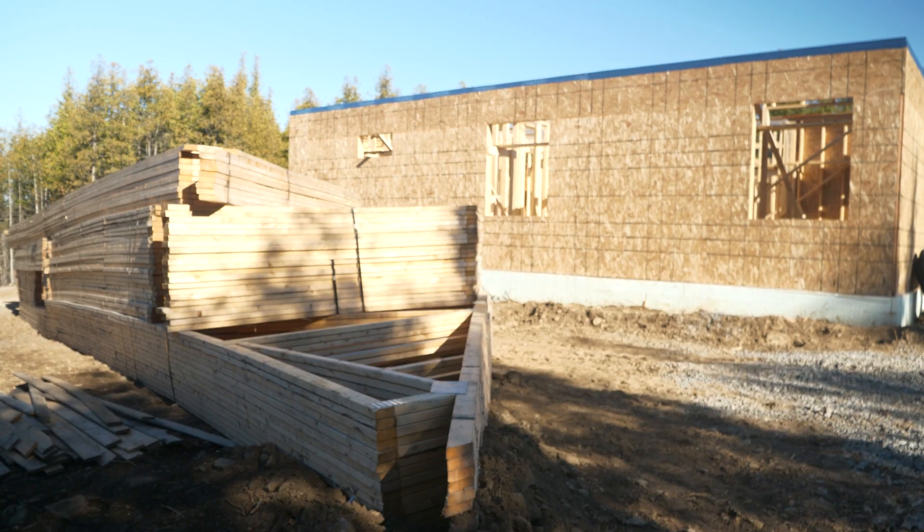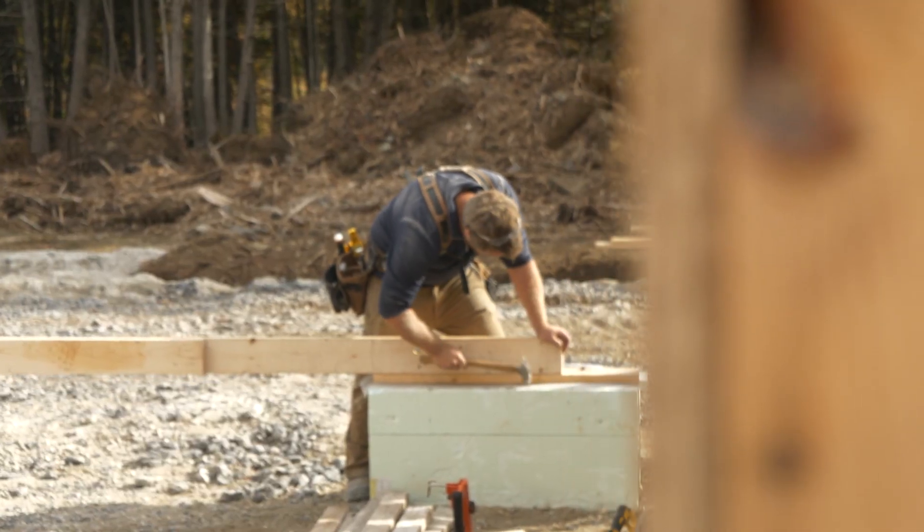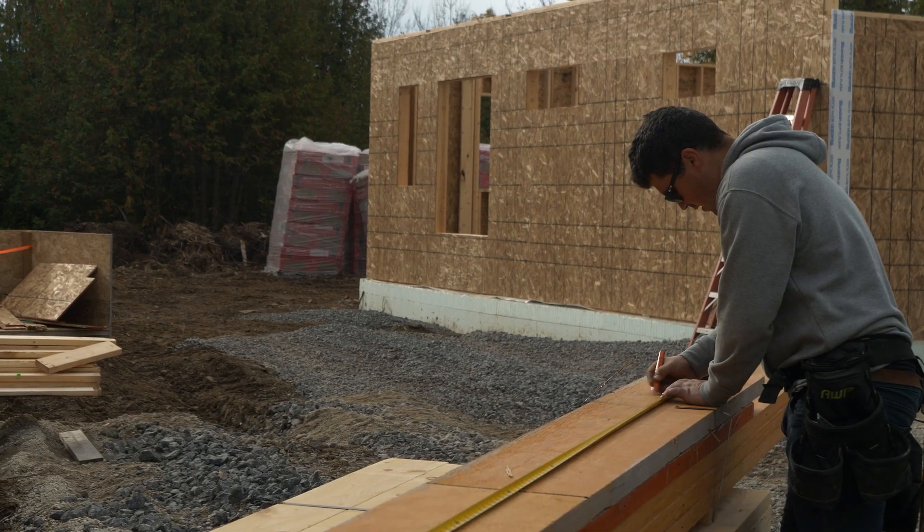Because every penetration through that air barrier in the attic — on the underside of your trusses — is a leak. It's a place where air will be leaving your house and you will be losing energy throughout the entire year. Here at The Conscious Builder, we are always aiming for 0.6 ACH, which is passive house air tightness on our projects, and details like this are sometimes what it takes to make it happen on custom homes.